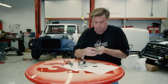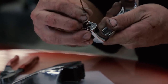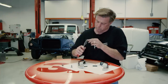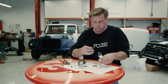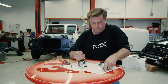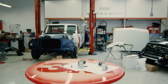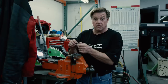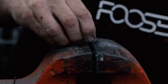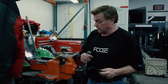Let me check it — that looks pretty good, maybe just a touch more. Now I'll take the stud over. I'm going to put a little bit of heat and then bend it so I have that same angle. I know I want about a half inch of this stud to go into the back of the door handle, so I'm going to create the bend after that half inch. The reason I'm using heat is this is actually a hardened bolt, and if I tried to bend it cold, it would just snap.